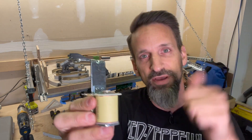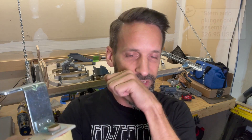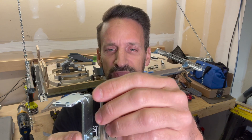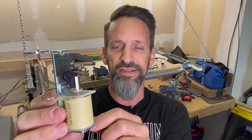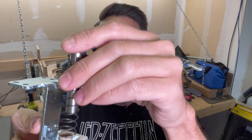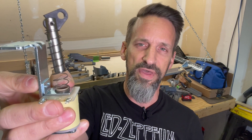So how are we going to go about that? Well, I went to my friendly pinball supplier, pinballlife.com — shout out to Margaret and Terry over there, they are doing a great job. And I found a Stern auto plunger bracket. It came with the bracket that's going to mount up underneath the playfield with the coil and the coil stop. And then I got a separate replacement plunger that goes from a flipper mechanism, and that's going to fit down inside and pull it down. We also need a high compression spring — this one's a little taller than what we need, so we'll cut that down to the right height.